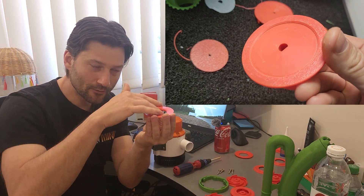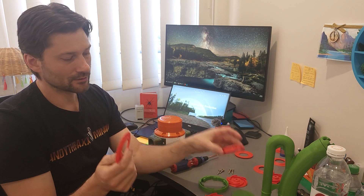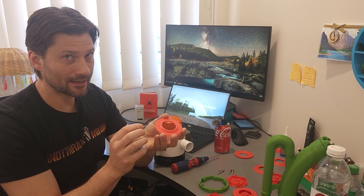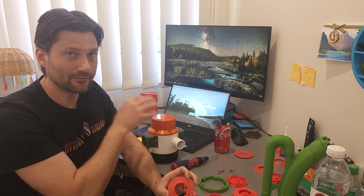If you don't do that filament switch, you can't separate the support layer from the part in a nice clean smooth fashion. Also, with the shroud on the inside where the water goes, it's a nice rounded curve, and on the outside there's a flat layer where it raises up — so it prints upside down and does that filament switch. Not everyone has a printer capable of that. This is printed out of ASA — think of it like a UV-proof version of high-impact ABS. It shrinks slightly when you print it. I originally started with PLA, but PLA isn't very temperature resistant; if you run the pump dry, the shaft rubbing against the rubber seal creates heat. I was concerned a PLA impeller would get too soft and loosen that connection. So I went with a more heat-resistant plastic, and because ASA shrinks differently, I had to change the shaft dimensions — each filament requires a different model to make sure it fits precisely.